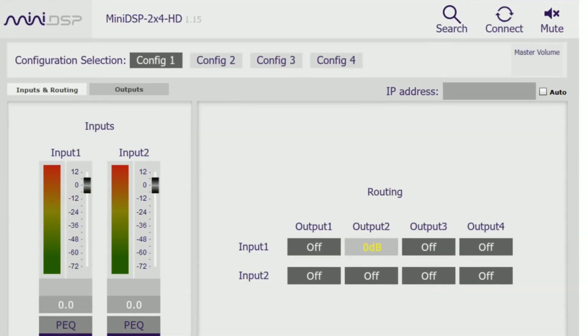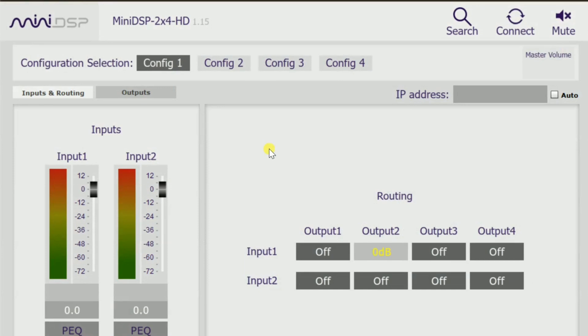Just to hit on something I missed in Episode 7 and have since put in the description — not everyone looks at the description. If you're not getting any output to your subs when you're connected, there's a selection here, Option 2, for USB or analog input. Sometimes it defaults to USB, and if it does, you won't get any output to your subs. So make sure it's selected for analog. You can get output through the USB cable, but with that method you can't see your sub to mains to make sure they're integrated right.